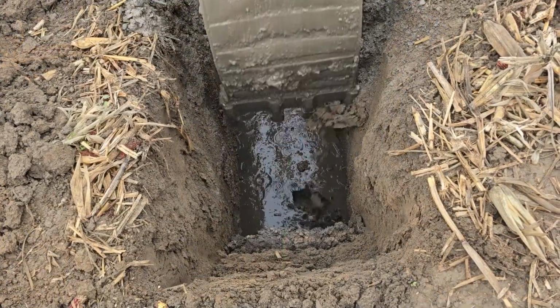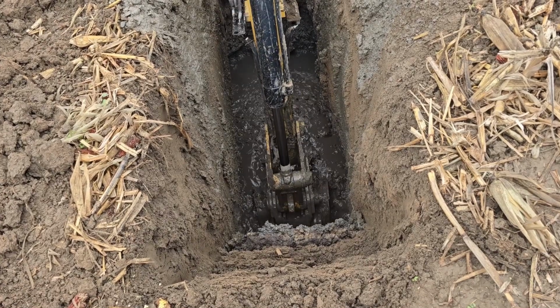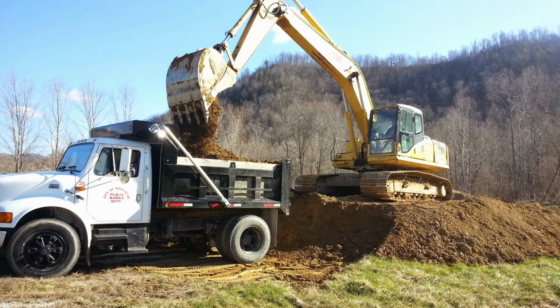Do not use the compacted clay liner technique if water enters the test holes you dig. Use the groundwater technique instead. It may be necessary to haul in clay with dump trucks if you want to build a wetland on a site where there is not at least 4 foot of clay near the surface. While this practice of transporting clay sounds reasonable, it's actually very difficult and very expensive to accomplish.